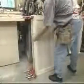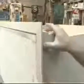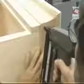All right, we'll set this aside and go back to work on the cornice. Now this is the molding that I made last time. I've mitered a couple pieces for this first corner. I like to nail one piece on so it makes it easier to hold the other piece as I mark the other end. Now that fits pretty well, so while I hold it at the miter, I'll mark the other end. Good. All right, now we'll wrap it with a little bead.